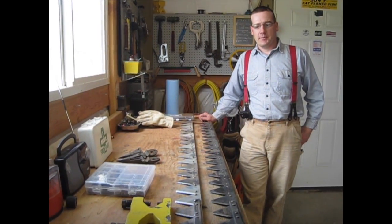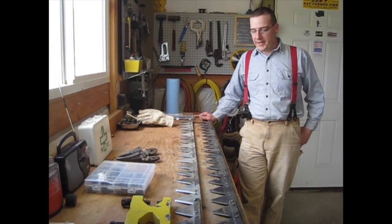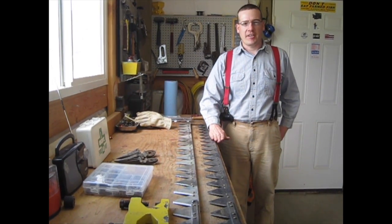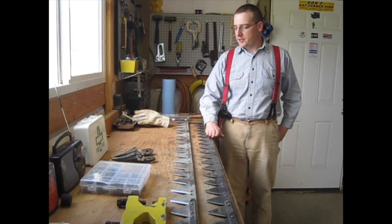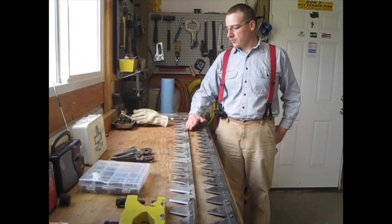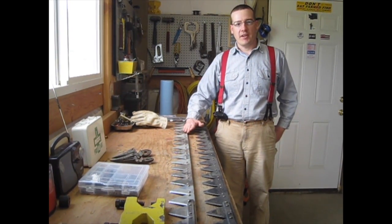I have a couple knives for my Cub 22 mower. I have one which I call my hay knife — because of the wheel on our outer shoe it always rides high, so I don't have to worry about hitting rocks. I want to keep this one really sharp and super well maintained. This is what I call my weed knife. It runs lower, I might hit a little rock now and then. It still cuts but it doesn't do as fine a job.